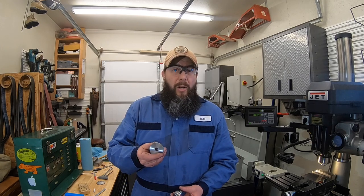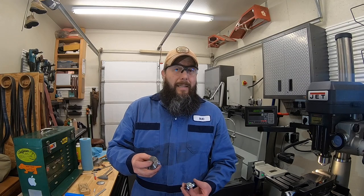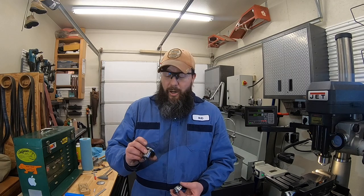If you've got a brand new boring bar, then just make sure you're taking your time with it, taking your finish cuts. Pay a little more attention to what size drill I'm grabbing. Here I thought I was grabbing a 32nd under and had room to go, and I only grabbed a 64th under. So just because the dimension you're going for isn't a super precise one, I got to slow down, make sure I'm paying attention. So good learning on that part, and really happy with how this turned out. Hopefully it gave you some ideas for your shop.